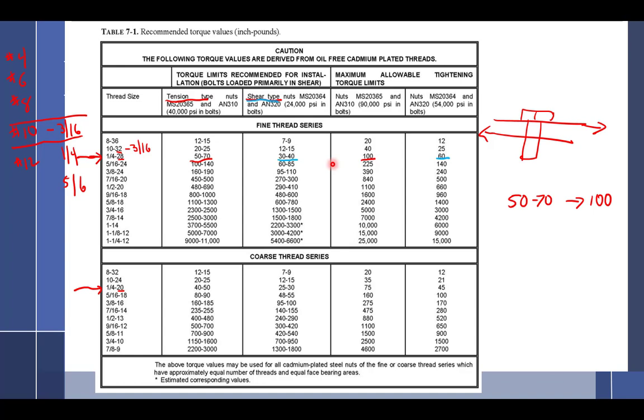It is the pull. So what the engineer figures out is every time the cylinder fires, that cylinder is actually trying to leave the crankcase. It's trying to go that way, trying to go away, and it pulls on the bolts every time it does that. Well, if you have the bolt stretching and relaxing every time the cylinder fires, it won't last very long and it snaps. So you have to have that bolt pulled tighter than the cylinder ever puts pressure on it.